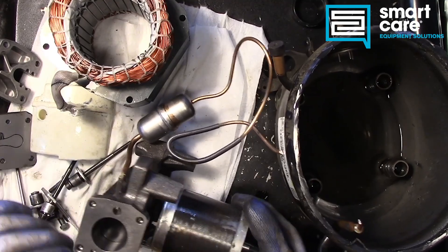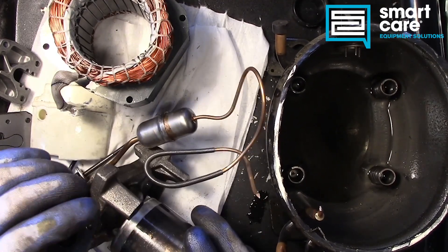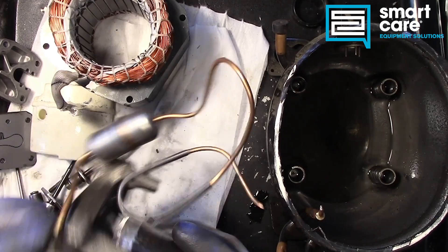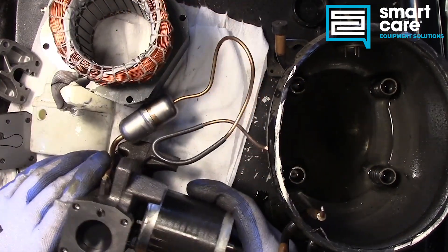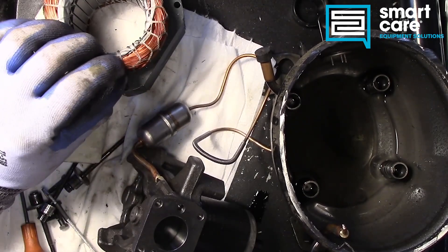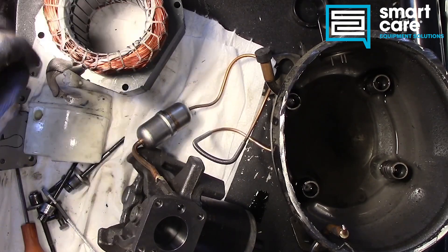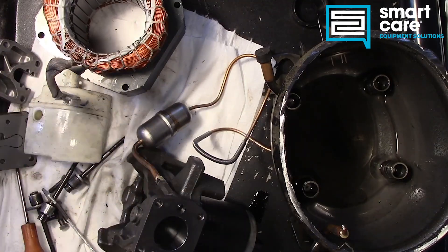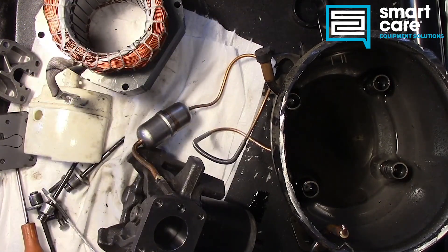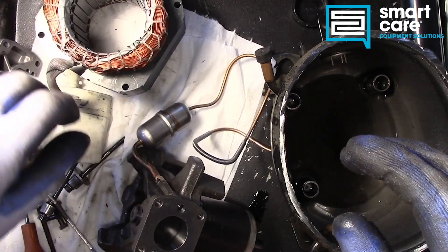Mechanically, we have bearings in here and oil on the bottom. It's possible for this oil to become contaminated through a system failure or to become acidic and start to etch things. As that happens, it's going to tear up the bearing surfaces we rely on for precision movement — that's another way failure can occur. We can also run into that same acidic oil beginning to etch the enamel on the windings, causing them to short. We can have a burnout which contaminates everything. If we have an electrical fault and it starts arcing, that arcing generates an electrical plasma that starts to disintegrate the refrigerant and the oil, creating a pretty big mess.